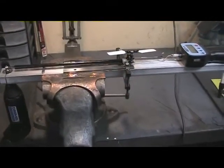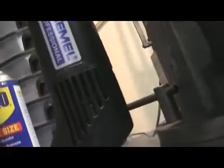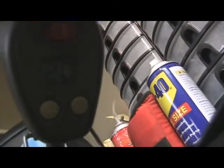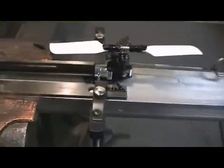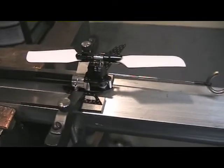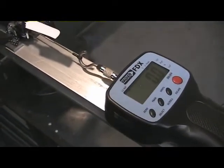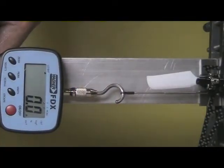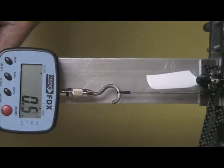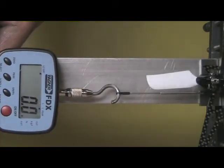Test setup for the T-250 tail, showing how we're powering this at speed. We've got a variable speed Dremel tool here — speed is adjustable up to 30,000 RPM, so we're just going to run it at 20,000, which is just about the tail speed of the heli in flight. We have our tail section fastened solid so it's not going anywhere, and we have our trusty force gauge sitting there. Just checking the pushrod force through the range — it's roughly less than half an ounce as we go through the full range.